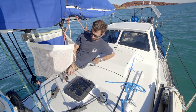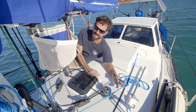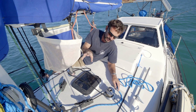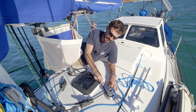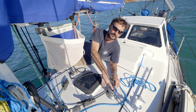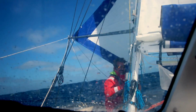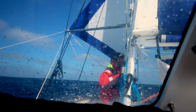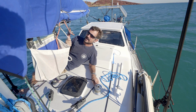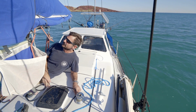It's been very straightforward. So we use these winches as the halyards for the headsail. There's another one there for the foresail. They can come back to these winches. Everything's got a jammer, and also we're putting our reefing lines here. We found that having the winches is really great when we're poled out and reefing. It's very, very hard to do it by hand. The only one that we can adjust just by hand is this particular one, and that's our outhaul, and that's because we've put a 4-to-1 inside the boom, but we've covered that in our refit as well.